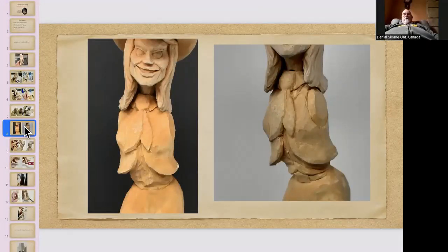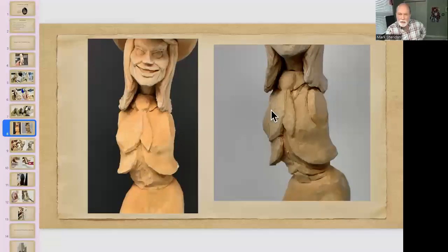One of the things I do try to avoid, though, is making too deep a cut on anything, because if I had made a real deep cut here and later found out I wanted to move it, no matter how much of this material I pull out, I'll still have that deep cut. So my cuts prior to a stop, like the stop cut before you make the side cut, I keep them pretty shallow so I still have a little wiggle room.